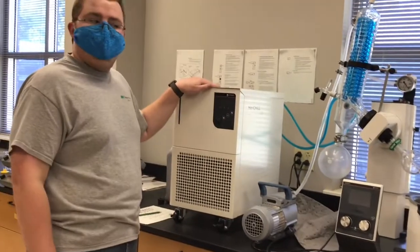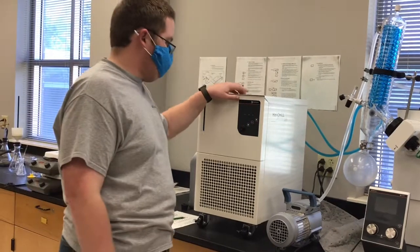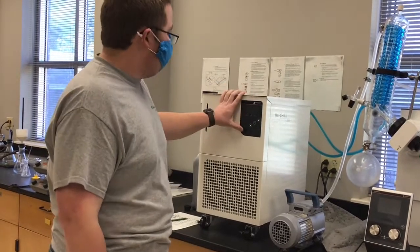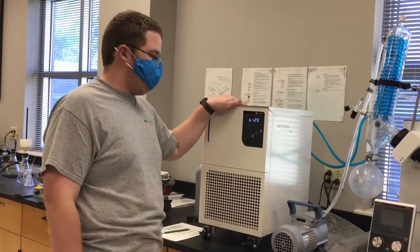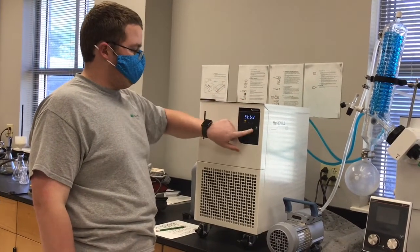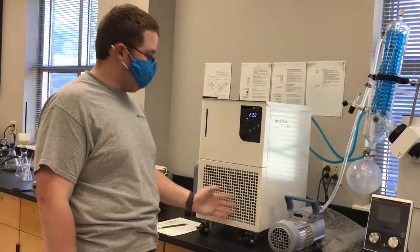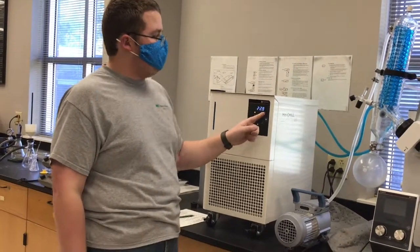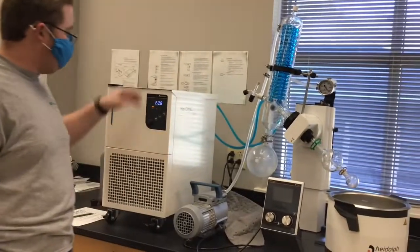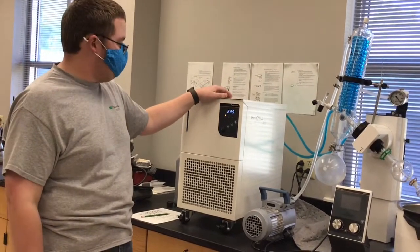Ideally when you come to lab, everything will already be turned on. But just in case you happen to be the first person over here and it's not turned on, for the chiller, you turn on the power button and you wait until it says standby — that's 'STB' — and then when it comes on, press select, wait a second, and it will start on its own and begin cooling. You have to give it some time. This is the degrees Celsius on the inside of this fluid, the coolant that's pumping around. At 22 to 23 degrees Celsius, that's room temperature, so it's not super efficient at the moment and you have to let it cool a little bit longer.